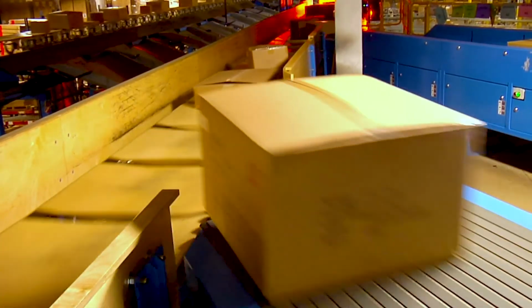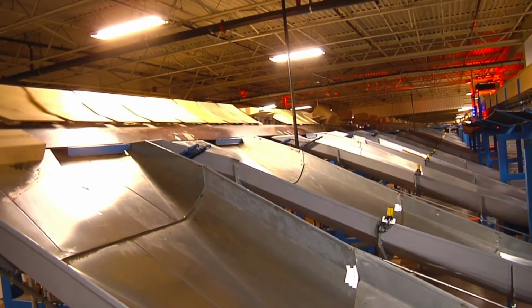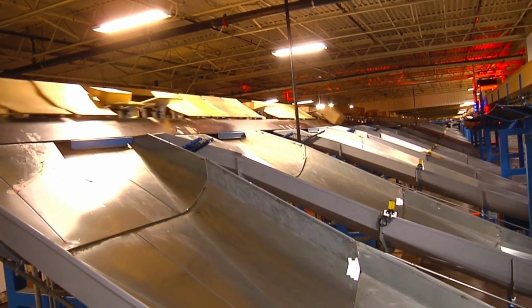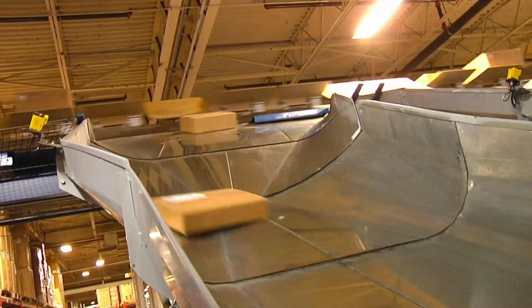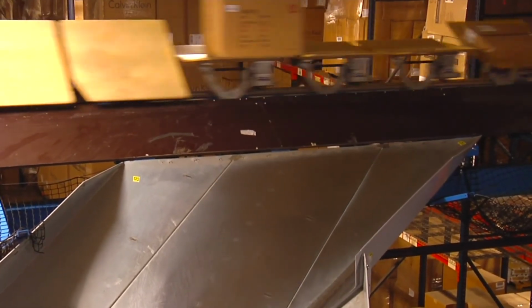It's a laminated birch plywood tray, which is either 3 or 4 layers of 3 millimeter plywood, and then we shape it with a template. We also incorporated a finish to it. It's a marine grade resin, wears like iron, and we still have original trays, 20 years old, still running on the original install. All the steel components are made in Pacoima manufacturing plant.